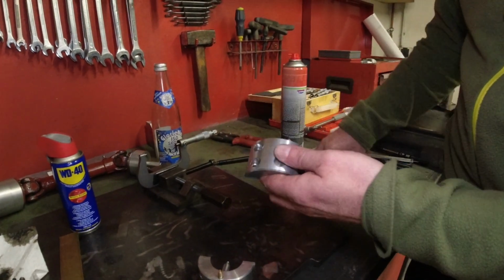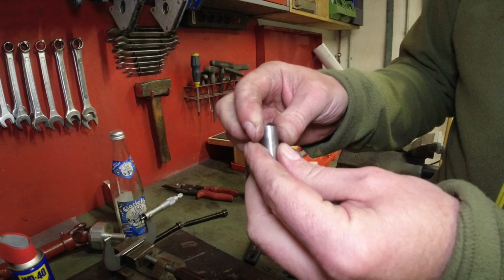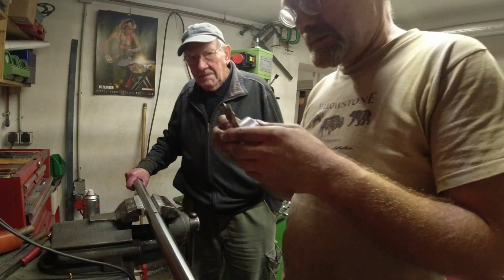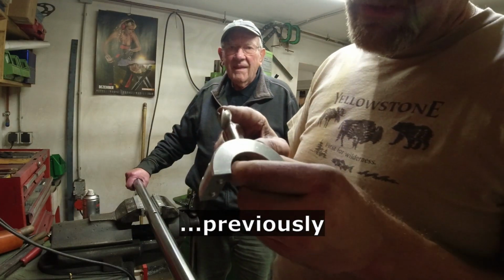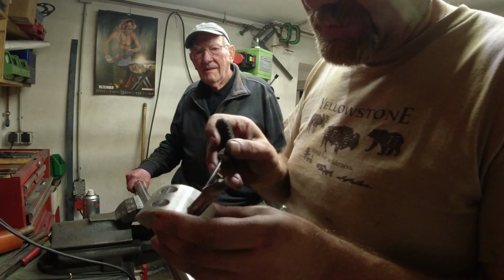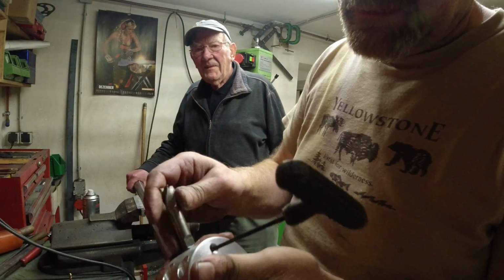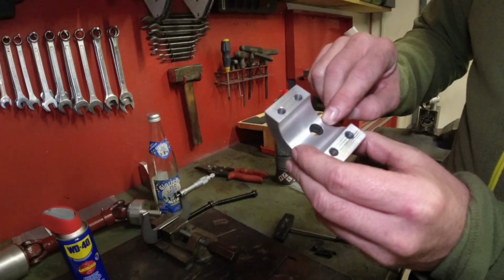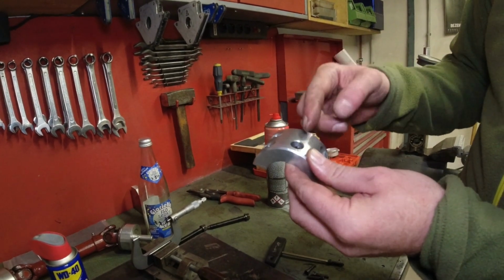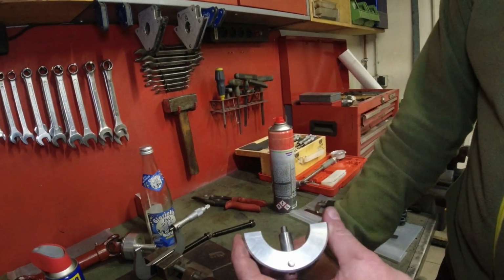Okay, first of all, the cutter with the little set screw here on the side is ground out of a 12mm HSS end mill. So the idea is to make now a cutter out of this piece of high-speed steel. It even got already a flat right here, so I can use this flat. Then there is a 12mm hole bored here, and of course a 6mm set screw to go against the flat. And then this whole pattern is just to mount the 2 pieces together.